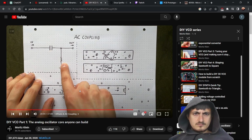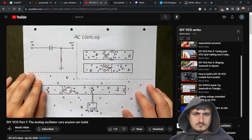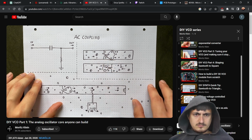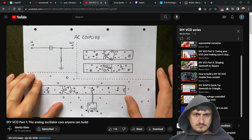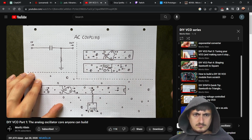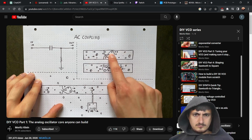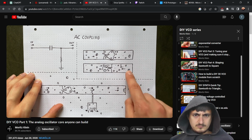A capacitor and a resistor set up like this. Here's how it works. First, imagine two pipes being connected with a balloon between them like this. Now, no water can get from one pipe into the other, since it's blocked by the balloon. But, and that's the kicker, water from here can still push in this direction by bending and stretching the balloon, causing a flow in the other pipe by displacement, and vice versa.